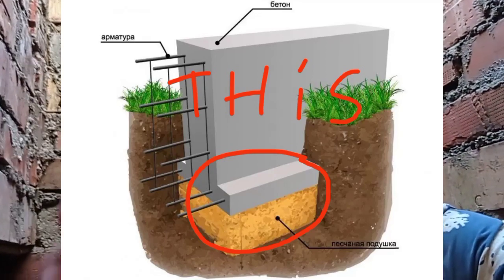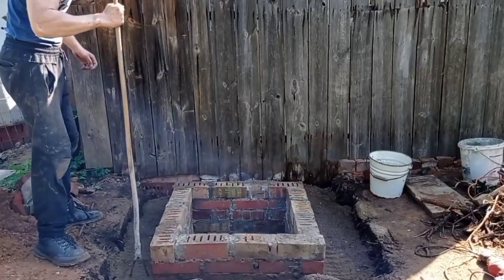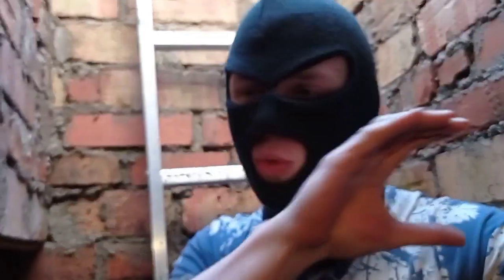I don't know what this layer is called in English, but in Russian it's called Podsipka. The reasoning why you want to put a layer of sand beneath the foundation is really simple. The dirt, the clay and everything like that, when it gets moist it obviously expands, and when it gets dry, the ground shrinks. You don't want that shrinkage, so this layer of sand acts like a buffer — it squishes and stretches and doesn't let the walls go up and down when the weather is either dry or wet. I poured a bunch of buckets of sand for the Podsipka layer, then did a quick up-and-down motion with my little hoe to compress the sand, and also dumped quite a bit of water on it. Water is the best way to compact any type of soil — clay, dirt, sand, doesn't matter. Water does a really good job at that.